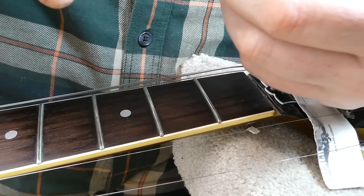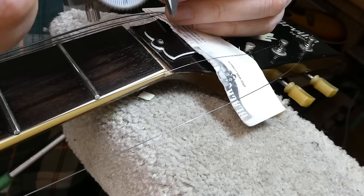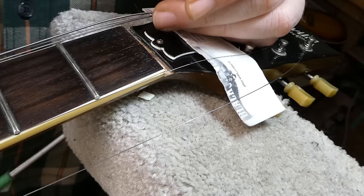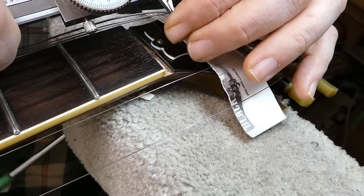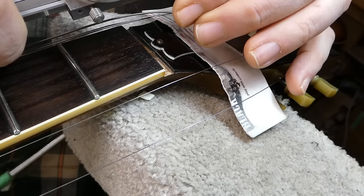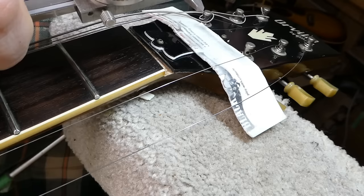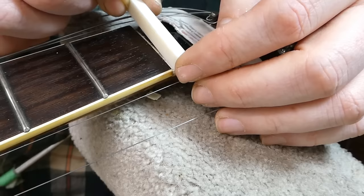I'll measure the width of the nut. It varies a bit, somewhere around 190 to 192 thousandths. It seems to widen from about 190 thousandths on the bass side up to closer to 198 to 200 thousandths on the treble. There was a question about my digital calipers — which ones do I prefer? It really doesn't matter. If it's less than a hundred bucks, they're all basically the same. You could spend huge amounts on Mitutoyo or Starrett calipers, but for woodworking purposes I paid 39 bucks for these and they're fine. I've got a bone blank here which I've thinned down on my drum sander to just over 200 thousandths, and I've been sanding on a flat block so one side fits nicely.